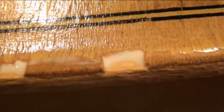On the back side we have a whole bunch of little chips, but there's only a couple places where there is lamination separation. You can see these chips here — like that one right there. I've got little tiny edges of glue on there, and that is to prevent — it's called sizing the edge — so we're sizing the edge with glue so that you will not get laminate separation later on.